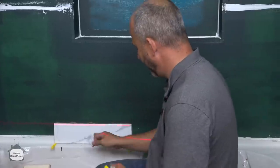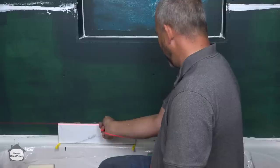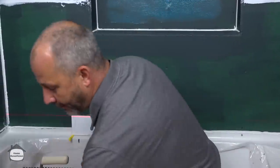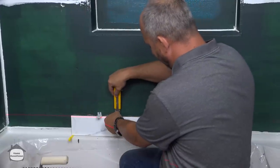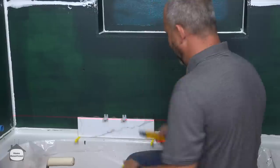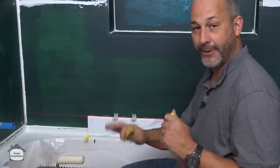All you need to do is take your little clips — knowing that you're doing a half offset — put one to each side of the center line so that when you come back tomorrow your clips are in place. We'll just do that on every tile until the whole first row is done, and then we're good to go.